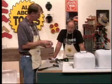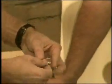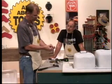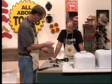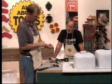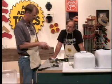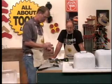They found out that they had some difficulties because where the stud went into the body, and I should really take this off so you can see it, where the stud went into the body in the back, there was little surface area to really hold it from pressure, and they tended to get some prying out when there was a lot of pressure. So they switched over to this style. By putting the stud into the center plate, which obviously this manufacturer was aware of from the beginning, you spread the stress over a larger area and got a better bond.